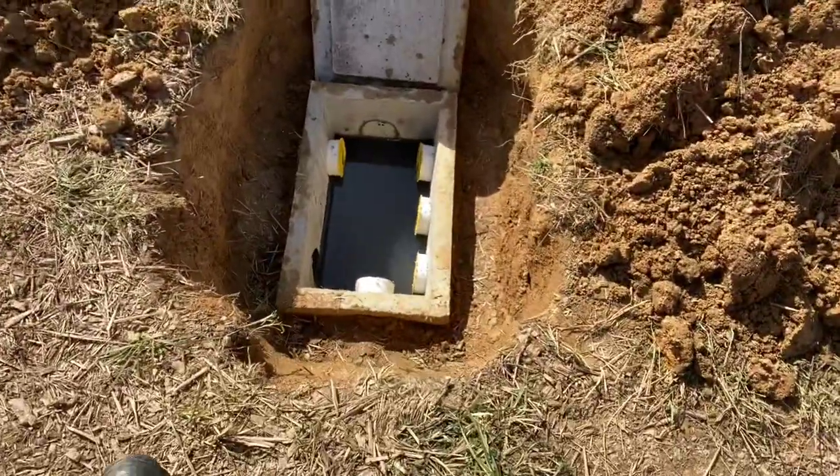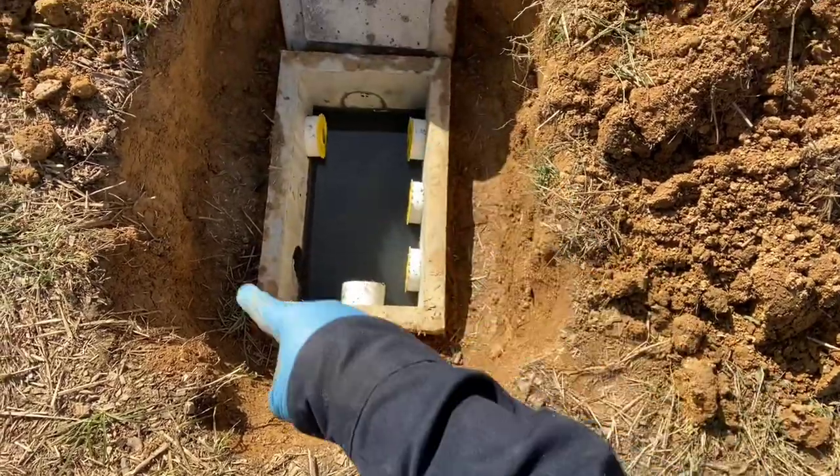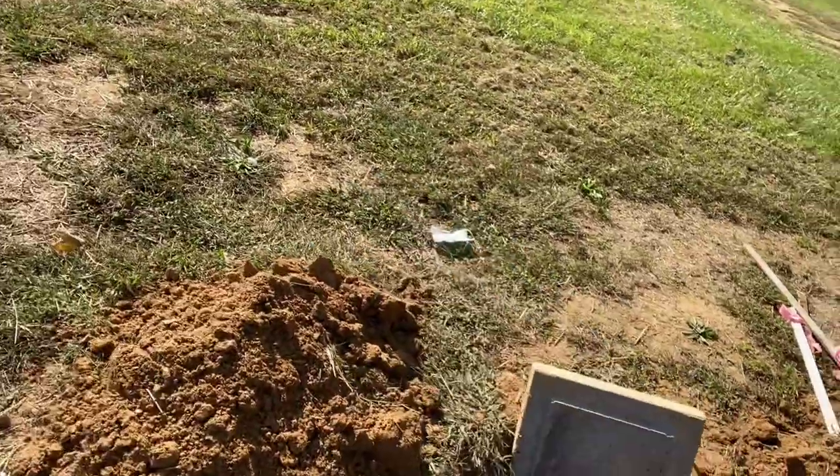A good line will let me do that with minimal resistance. Until maybe I get far, then I have to really push that camera in, because the pipes are supposed to be flat — perfectly flat. It's really about 2 inches per 100 feet in grade, which is essentially nothing. We're going to count these lines clockwise: line one, line two, line three, line four. Starting with line one — it exists as PVC, transitions to corrugated.